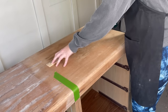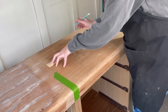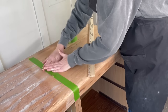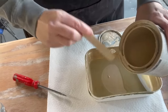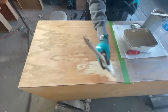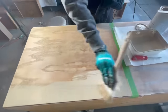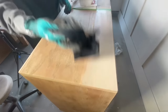I wanted to do a modern half-and-half pattern on this dresser, so I'm measuring out one side to make sure it's even and then taking that Sunday Tea paint to make a paint wash — one part paint and three parts water. I'll apply a nice even coat and wipe it back after it's set on the surface for about 30 seconds. I did this same technique to the drawers on the right-hand side of the dresser.